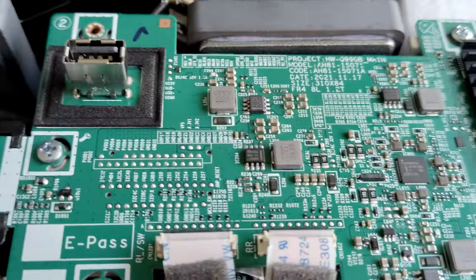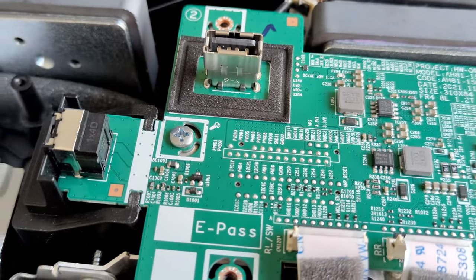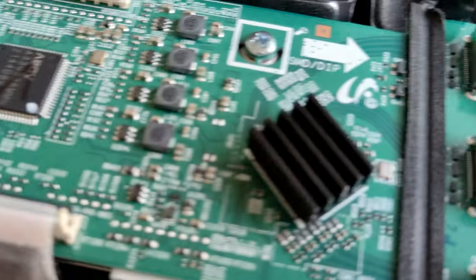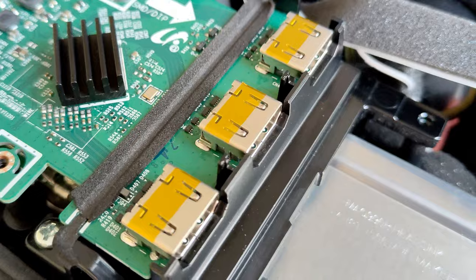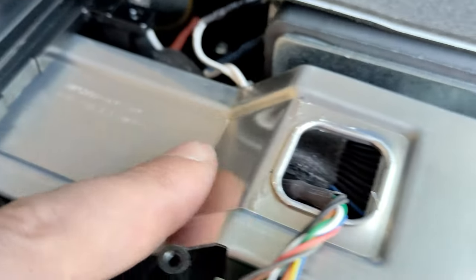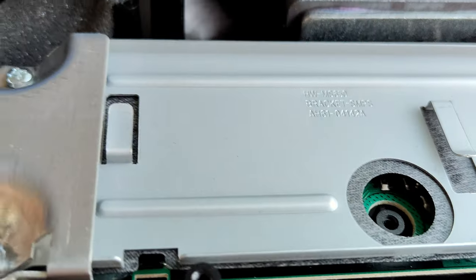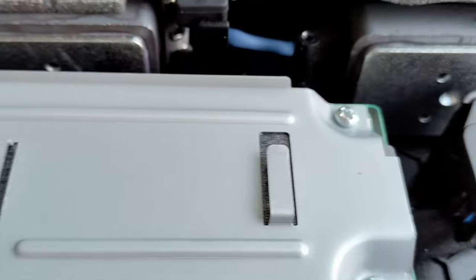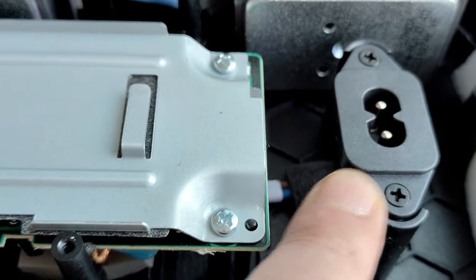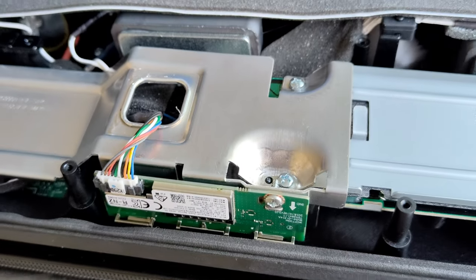because this soundbar contains around 15 drivers. We see the board here. This part is the switcher for inputs and outputs. We see the HDMIs. Then there is this chassis that holds the power amplification in place. This is the power amplification, class D. This is the power supply, because here we put the mains, and this soundbar needs a lot of energy to work.